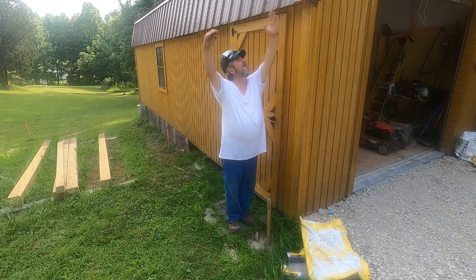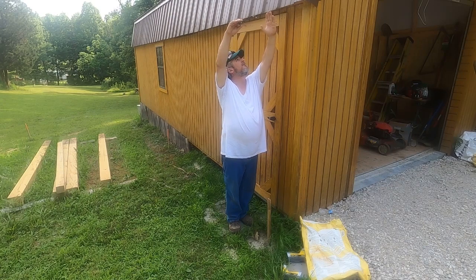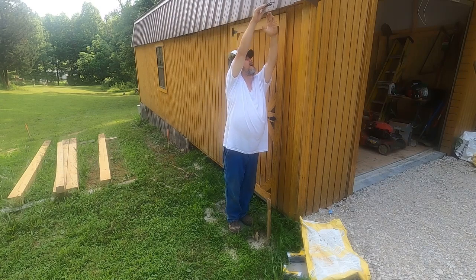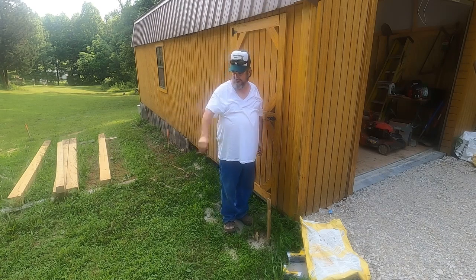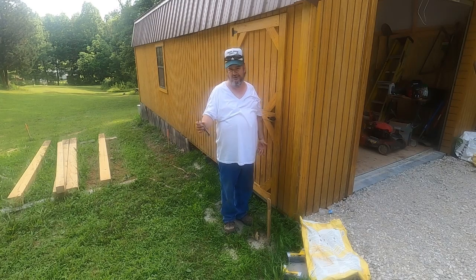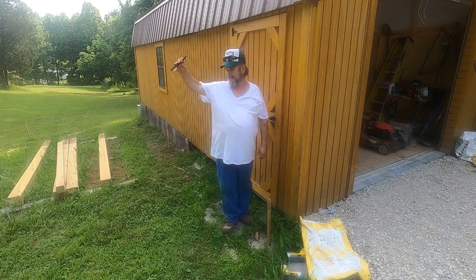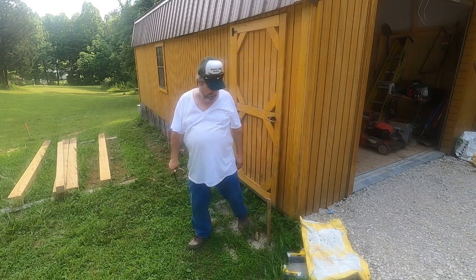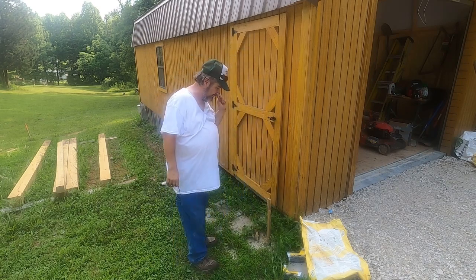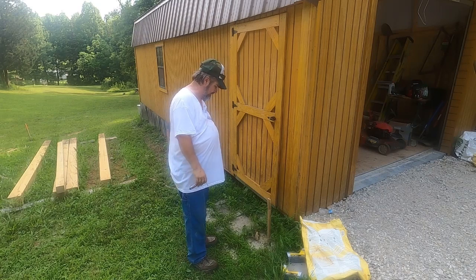And then when I put my 2x6 in, I'll slide it enough over to allow for that, because we're going 10 foot in between the posts, and I'm gonna get 12 foot 2x for the frame. And I'm going to use 2x4s for the top and then the metal roof. So I'm going to have to do these by hand.